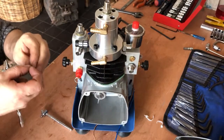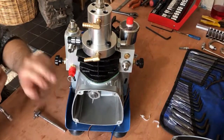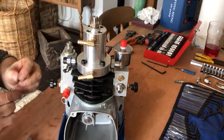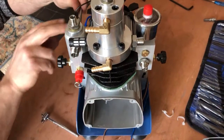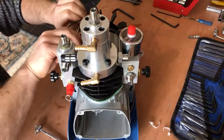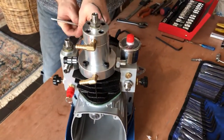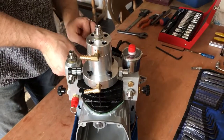Basically I think what these compressors are - if you look at a lot of small single-phase shop compressors, it's the same motor and so is the barrel. They've just put on a high-pressure head with obviously a high-pressure piston. So it'd be quite interesting to find a better quality one of these with a better motor and put the top on it.